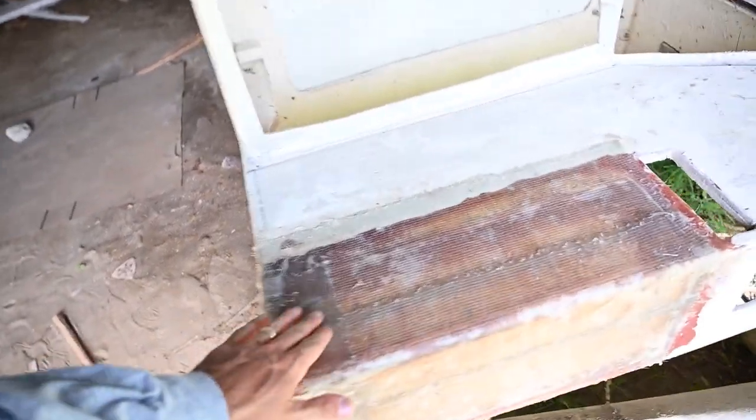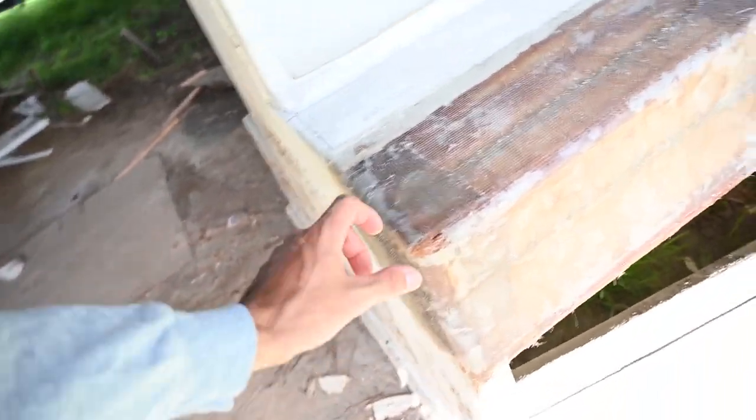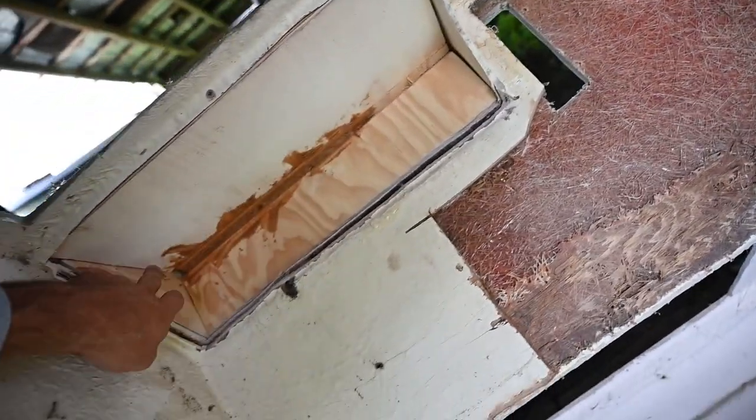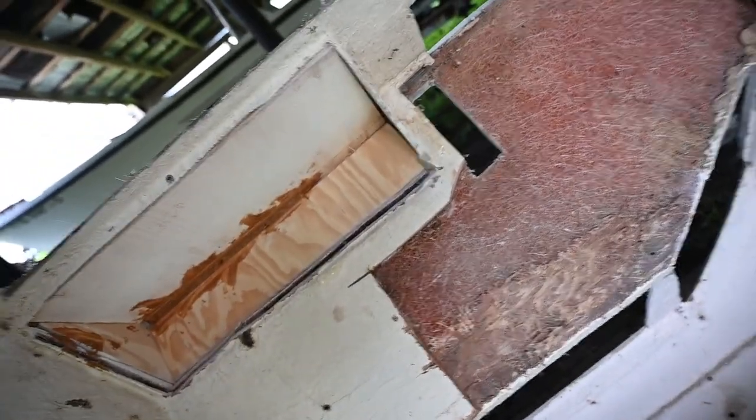All right, we have a big day ahead. I just got too pissed off yesterday and went home early and didn't feel like messing with it. But this is our dried console - at least I think it's dried. Yeah, looks good to me. I'm pretty stoked on that. I'll have to grind all this today and fair it obviously after. But before we do that, I'm going to have to fiberglass the bottom side of it. This is real white because of the fiberglass dust. I'm going to peanut butter in there, and then just throw a piece of tabbing here or there and coat the rest. I'm not too worried about it but I'll make sure it's all nice and coated.